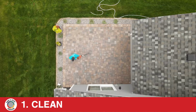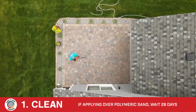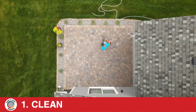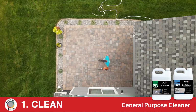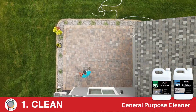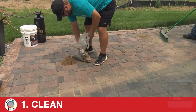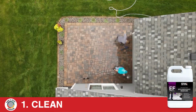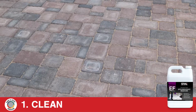Clean. If applying over polymeric sand, wait 28 days after installing polymeric sand before sealing. If applying over a polymeric sand install, it is recommended to use an SRW general purpose cleaner prior to the use of JS Joint Stabilizer. If efflorescence is present on a paver installation, fill joints with sand and apply EF efflorescence remover or PW paver wash to clean paver surface. Never clean a surface without jointing material between the pavers.